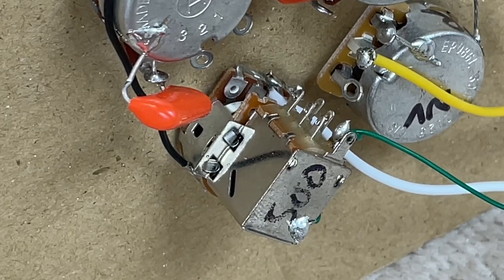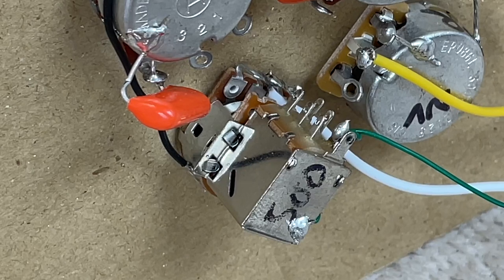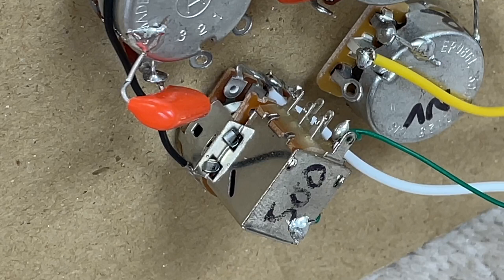Okay, so the black comes in on the top right-hand side of the switch. Let me just check that back. Yep. And then the next part of the black, one piece sticks up in the air like the green one, and the other piece goes across, down to the lug number one. So we only need a short length on there too. Now this is going to join with another short wire. In fact it could actually be this tiny little bit here, so we'll use the black again.